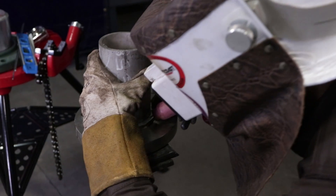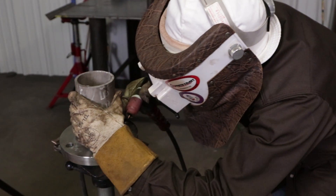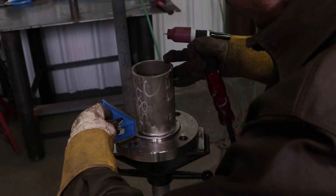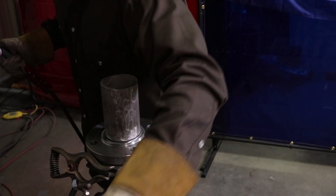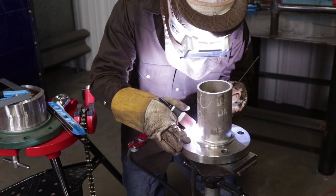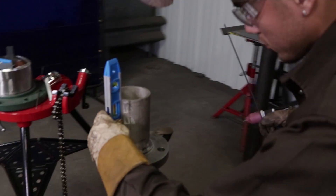Right now I'm gonna tack it. The flange I have is a 150-pound flange for 3-inch schedule 40 stainless steel pipe, which is the pipe that I'm tacking on. I'm gonna tack it in four corners, but before that I gotta make sure it's level — basic fitting for anything — and make sure it's square as well. Go ahead and tack the other side. Usually in socket flanges they have spacer rings on the inside, so that's what we put in there.